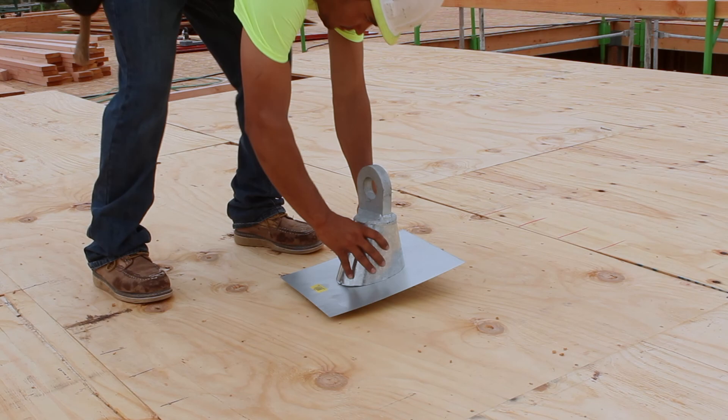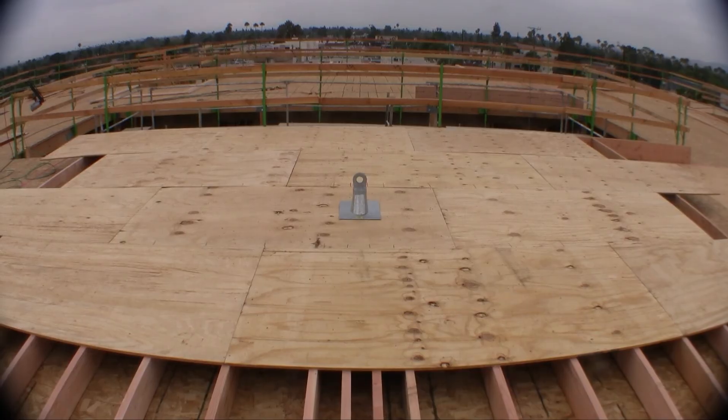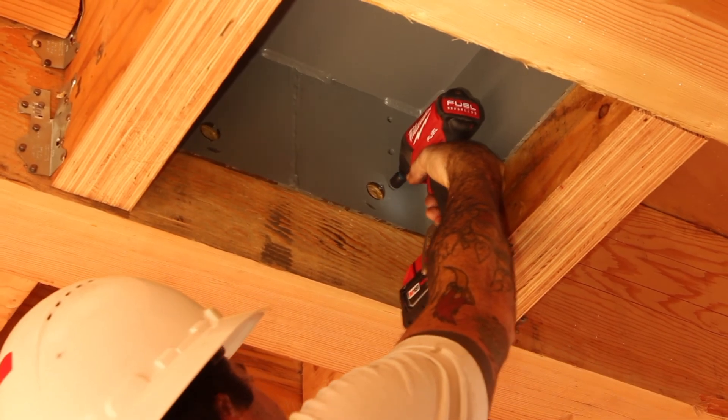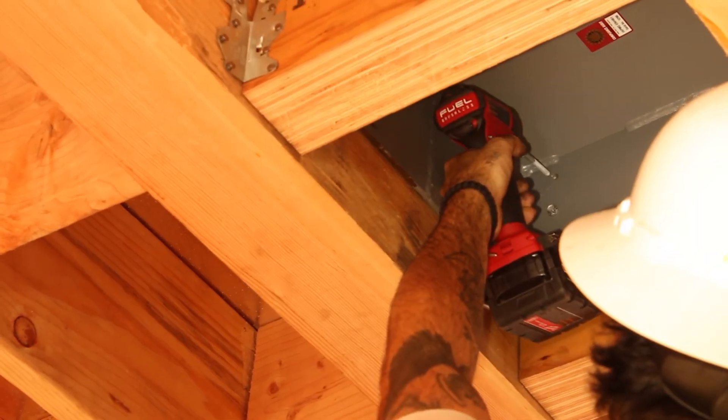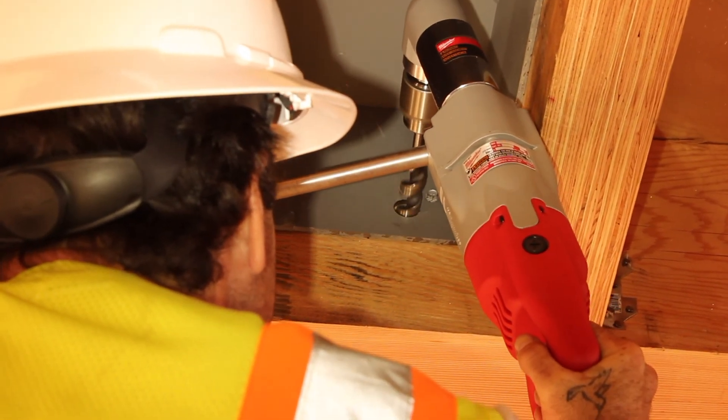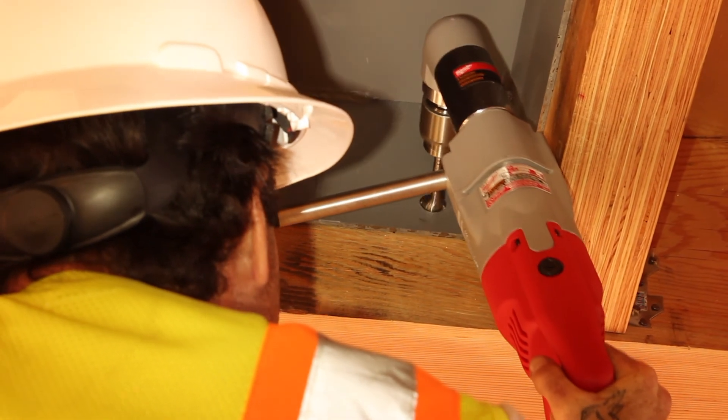The Hardee tieback device is fastened from the underside. First, install three ¼-inch by 3-inch SDS or WS screws into each block and beam at all four corners. Once all 24 screws have been installed, drill four 15/16-inch holes into the support beams.